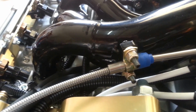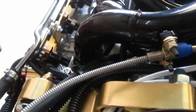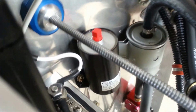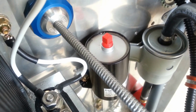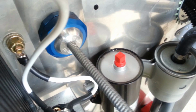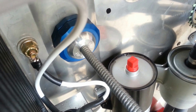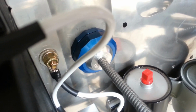Another nice feature about the throttle cable installation that we did here, because we wanted to do the prime example for you of what an installation is supposed to look like to be secure, is that we ordered what is called an eyeball from Aircraft Spruce as well. And we got the one that was 0.240 inside diameter, and it gives you a secure and nice way of bringing a cable in through the firewall and into the airplane.